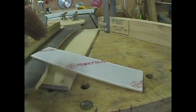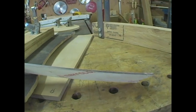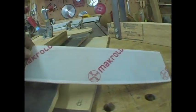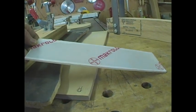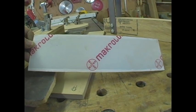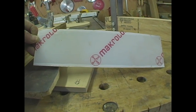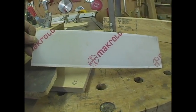This product right here is really good for underlays on jigs — to run up against a bearing, post, or whatever. I get it at Home Hardware, Home Depot, Lowe's, or wherever. It's Lexan — very strong, you can drill it and tap it. You can make an awful lot of anything using it as your rub substrate for the underside of any of these riser jigs, curved jigs, or whatever you're building.